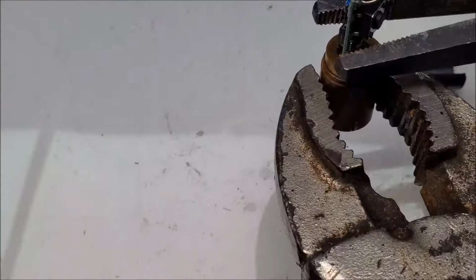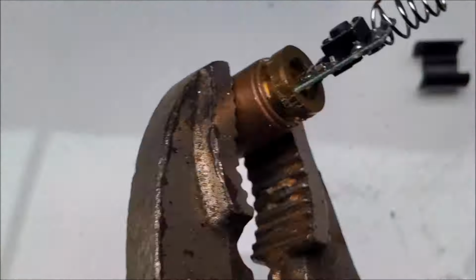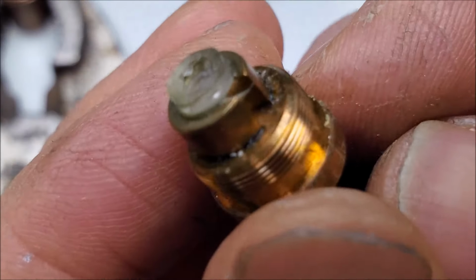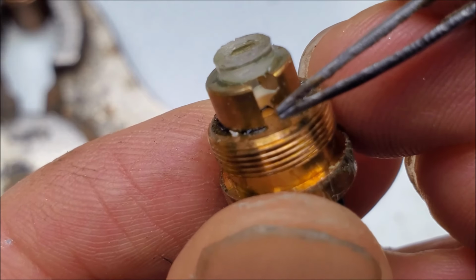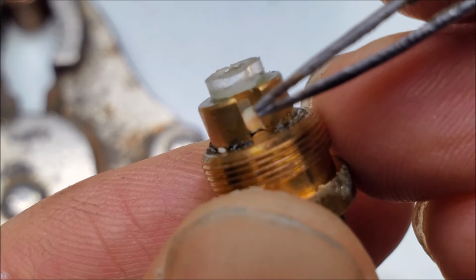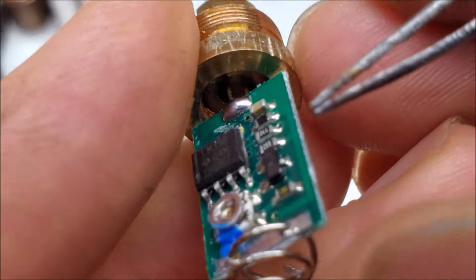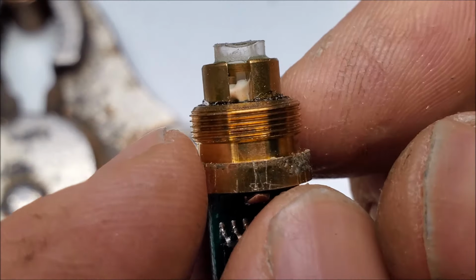Tools. Okay. Put that off to the side. Alright, so on the inside you can kind of see it. We have an open can laser diode, and the actual MCA, monolithic crystalline assembly, which is right here, is pressed right against the output of the laser diode. So there's no kind of condensing lenses on the inside. So that's how they used to look.